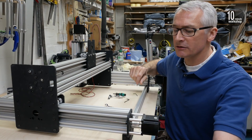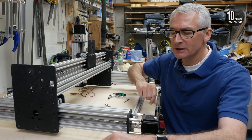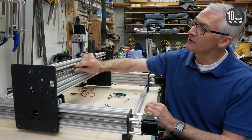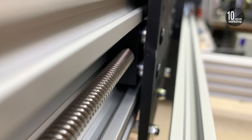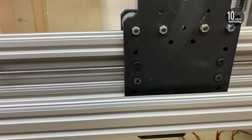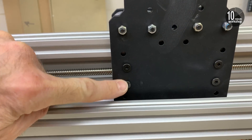So another day, here we are. I've got my replacement little Acme nut blocks — thank you very much FuseNest for those. They attach to the threaded bar at the back here, the Acme bar. The Acme bar threads through those and the blocks are attached to the X carriage backplate.